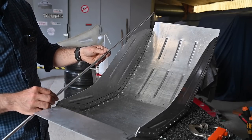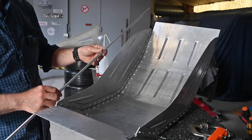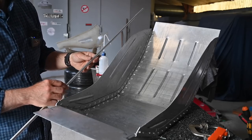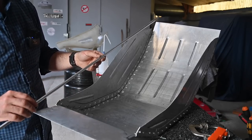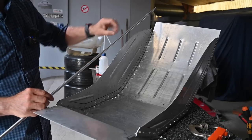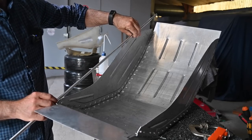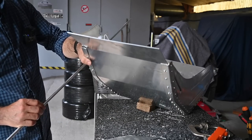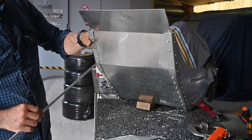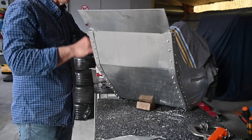Then I will have a very nice edge and I'm going to weld it with TIG just in specific places so it doesn't get loose. If you don't want to weld you can also make brackets over it and use a pop rivet — I might want to show you that as well just in case my welding doesn't work.